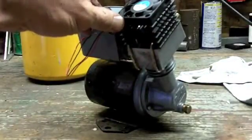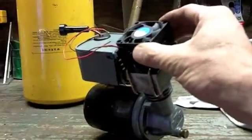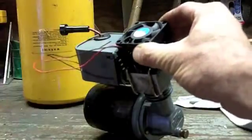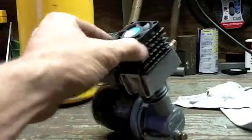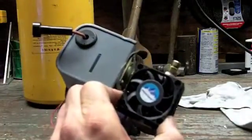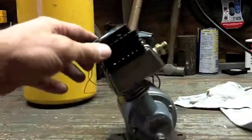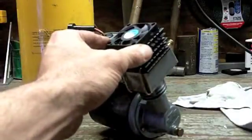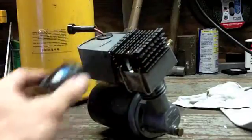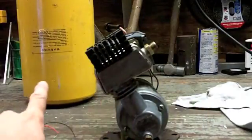My neighbor — kind of a joker — then goes 'oh yeah, there's another part to it,' and comes back with a little fan. That is sick because it combines the best of both worlds. I threw some graphite in there to lube it up. I'm going to screw this fan down so it sits on top of the heat sink — you can see the little screws right there — run the wire inside, and make it turn on and off with the compressor. An air-cooled little cylinder head. That is high-performance stuff right there. Next video I'm going to run this into the scuba tank and do some before-and-after heat tests.